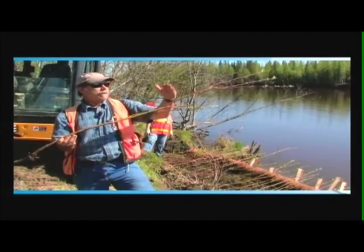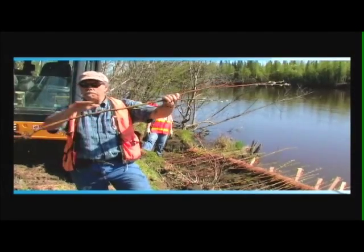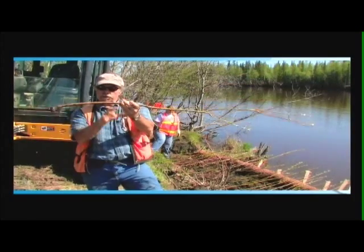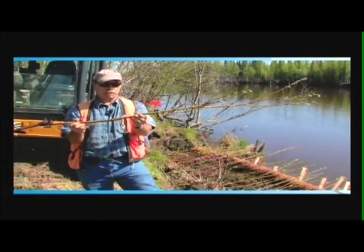We'd like these things dipping back into the slope like that — they've got their buds sticking up. This part of the branch is going to be buried in soil; it'll have perfect opportunities to root. Each one of those roots will provide some additional geotechnical strength.